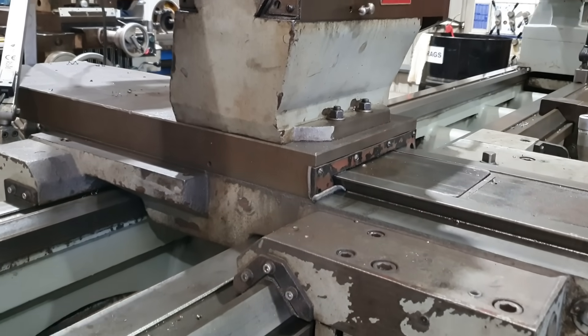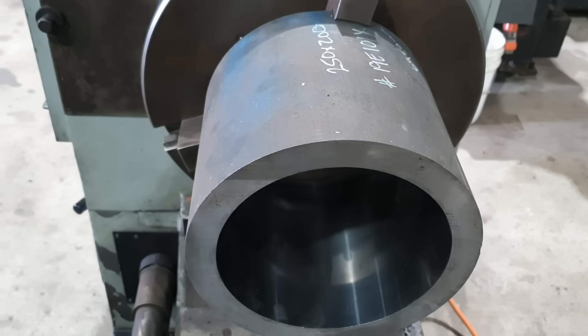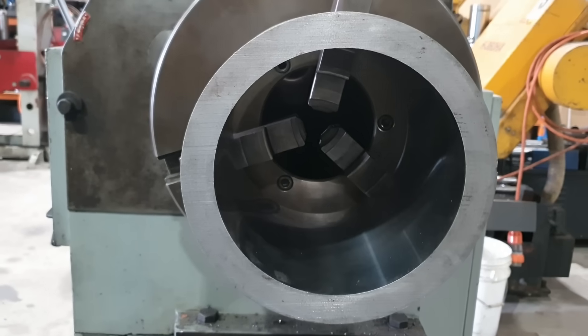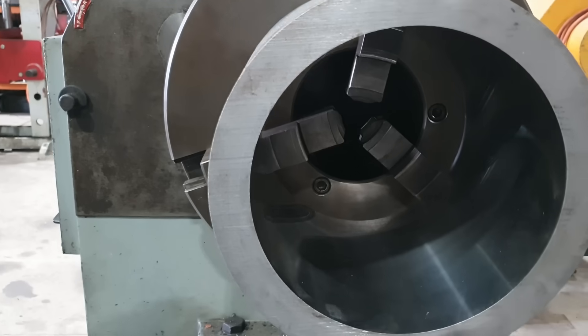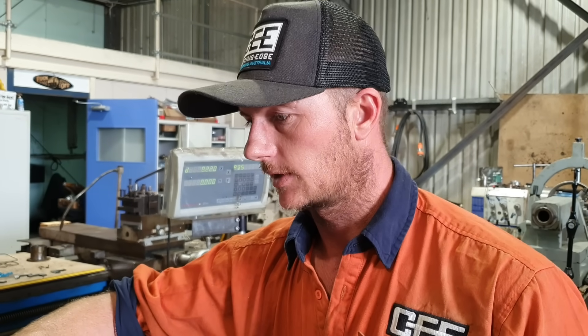The size of the carriage, the tool post and all the bits and pieces on the carriage is double the size of the one on our other machine. What we're going to be testing it on today is a piece of honed cylinder tube — 200 by 250 in diameter. It is quite a sticky material, a little bit better than mild steel, not quite a 1045. It's a very odd material when you go to machine it — it prefers to be flooded with coolant or oil, it doesn't like to chip, more comes out in strings.